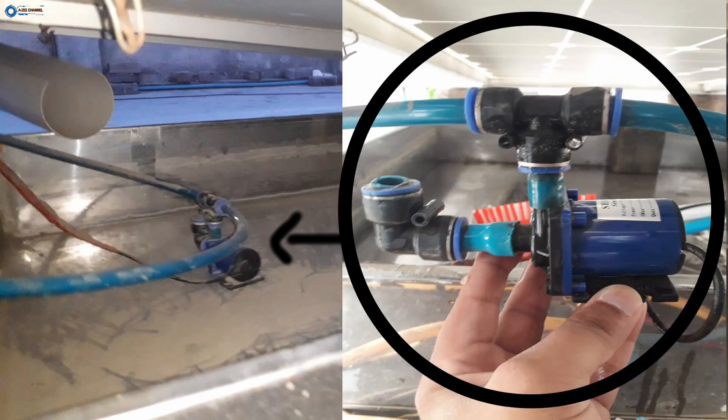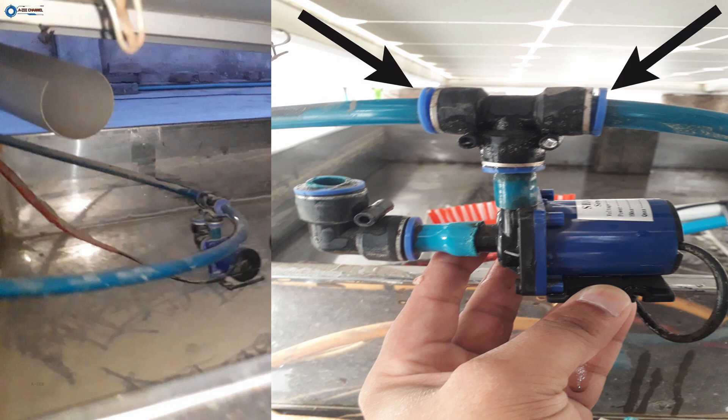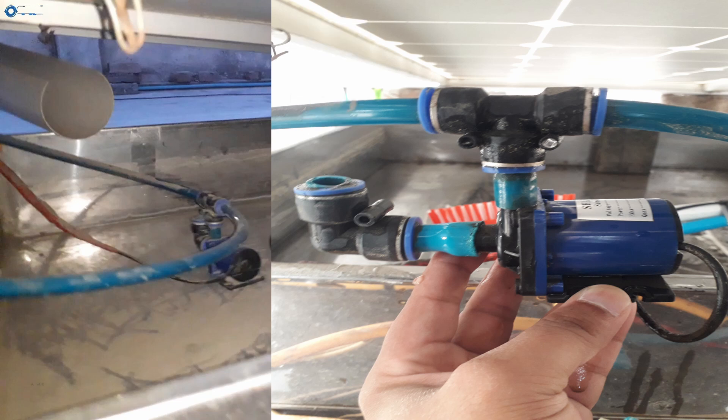This is how I arranged the water pump. There are two channels of water flow to ensure maximum water is pumped to the top of the solar panels. One side of a three-channel PU T-connector is connected with the water pump and the other two sides are connected with two PU pipes. On the pump suction side I use a PU elbow, which performs many functions — for example, we can add a small filter at this point. It also prevents the water pump from burning: these pumps are submersible and will burn if run without being submerged. The elbow stops water flow at suction so the pump turns off when no water is entering it, as this pump has a sensor and will not run without water going into it.